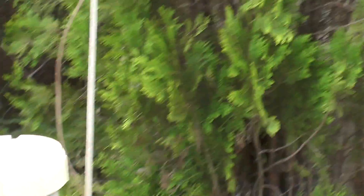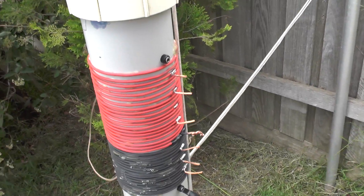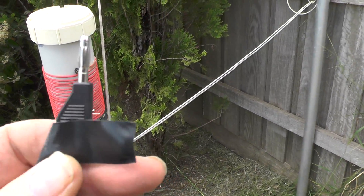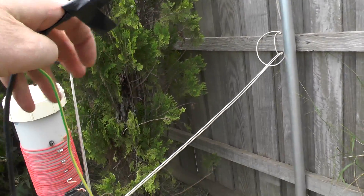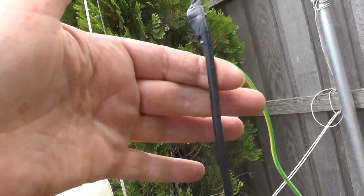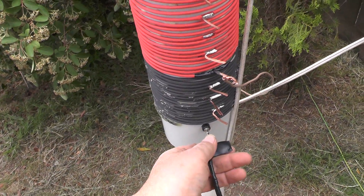So we've got the coil which has got all the tabs on it, and then there's a banana plug — the coax comes in, the banana plug is the tip of the coax, and then it splits out. The braid goes down to my earth stake, which I'll show you in a second. This is just the RG58 coax down to a PL259, and as I said it breaks out there and plugs into the start of the coil.